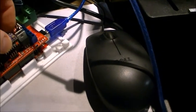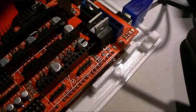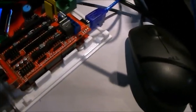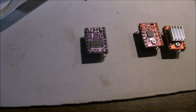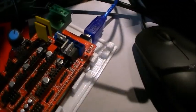So they will plug in onto your RepRap board into these spots for them, into these headers. But before you do that, there are a set of jumpers that have to be installed underneath to set what they call the number of steps. And to make your life easy, the dual end stop firmware available from the V1 engineering website is pre-configured for the 8825 driver chips, and you would install all three jumpers on the headers underneath the driver chips.